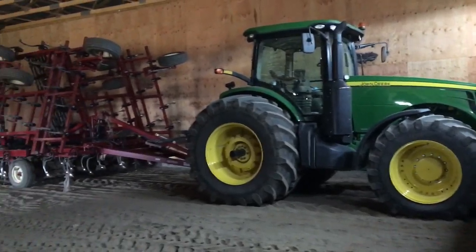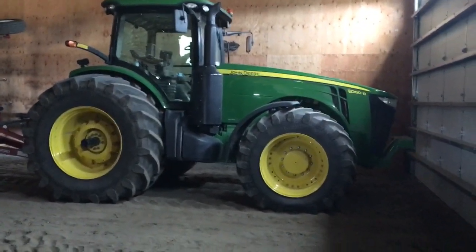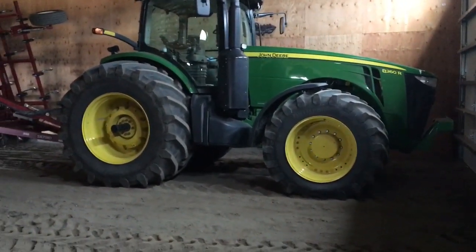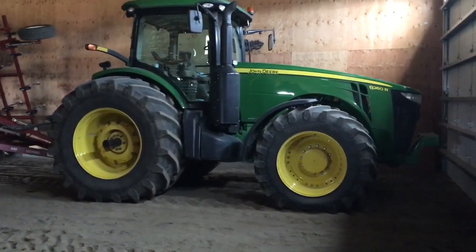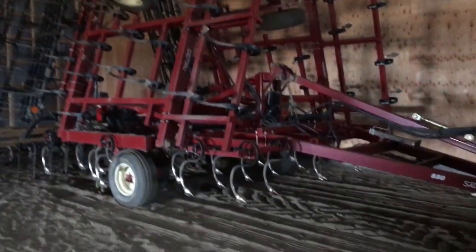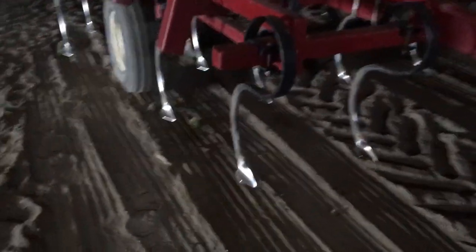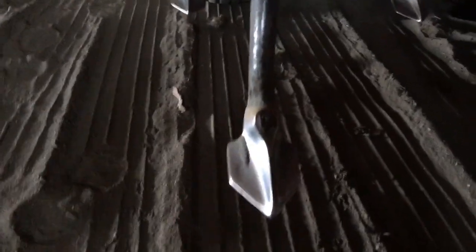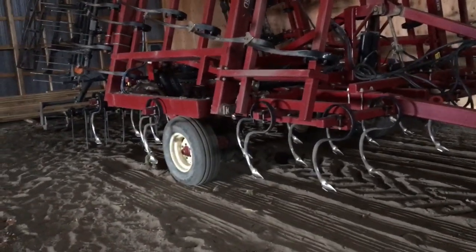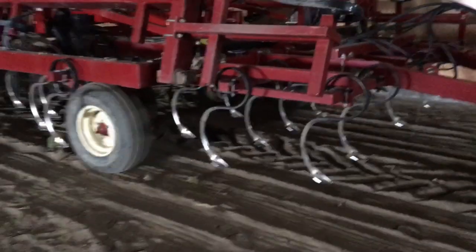The 8260R — my brother and I bought this tractor a few years ago used. It's a 2013, no DEF. It had duals on it when we bought it, but we put the big singles on because it pulls the manure tank, pulls wagons, and does a little tillage work. For going down the road, it's just a lot nicer with it being narrower. Salford cultivator, 30 feet. This has got smaller sweeps than some guys are using, but a lot of guys in this area like these narrower sweeps. They do a really beautiful job, don't wear out that much, and do a perfectly level job. We just like to tickle the dirt — we're just scratching the surface.